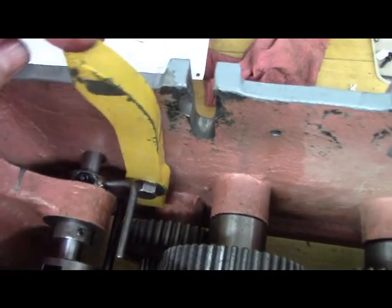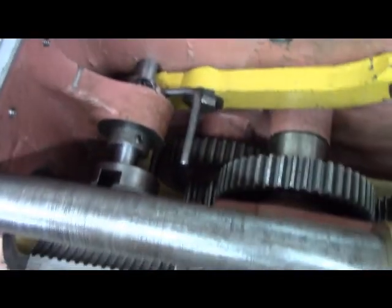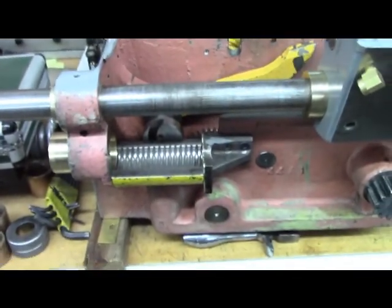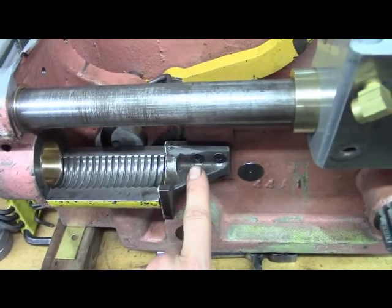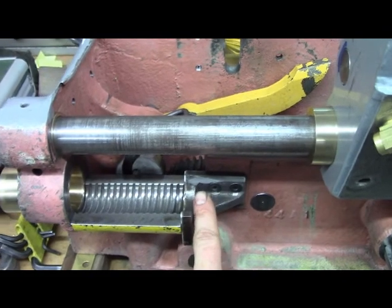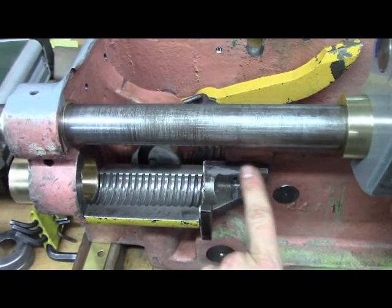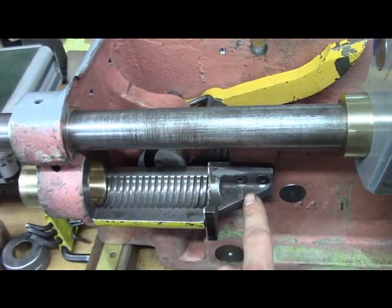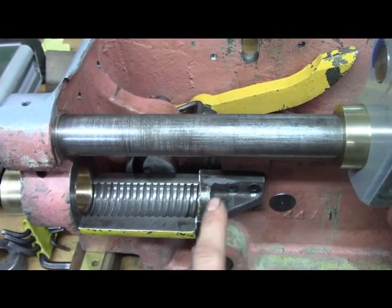So this yellow thing prevents the half nuts from being engaged. Let me back up here. Back on my stool. It prevents the half nuts from being engaged. Now, to catch you guys back up on this, I ground the cast iron angle bracket where I could see the little threads were hitting. Just took it with a Dremel and blended that. Just barely, so the witness marks from the lead screw having rubbed just barely disappear. So that's good clearance.